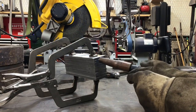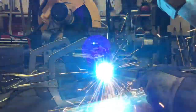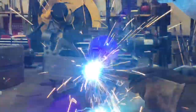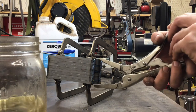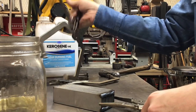I'm going to MIG weld the ends — this is 0.035 hard wire, and I'm just doing the ends, two welds on each end. They're going to get cut off when we're done, so you don't have to worry about grinding them smooth. I don't do any tack welds through the middle — that's part of the strategy of having that thicker piece on top and bottom, which really keeps it from separating much at all. I've had real good luck doing it like this.